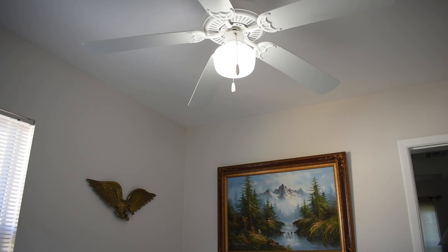This is actually very common in much older homes like this one. People hire a handyman and they don't do the job properly. What they do is just drill a hole in the ceiling, route the Romex wire through the hole, and they'll either put a hook to hang the fan or screw the mounting bracket directly into the joist. That's the problem with this fan — whoever did it did a lousy job, there's no electrical box. In this video I'm going to show you how to correct the problem to make it to code.